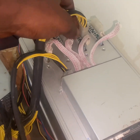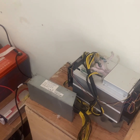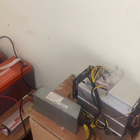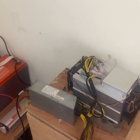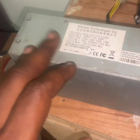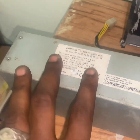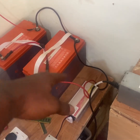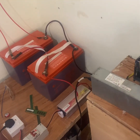I've already run some experiments. If you look closely, you can see I'm only using two hashboards right now. I was experimenting with all the hashboards and I saw that the power inverter kept shutting off. I realized it was the power consumption of the PSU — this power supply draws about 1600 watts, and the inverter is only a 2000-watt peak. I'm not even supposed to be running it near that limit if I want it to last long.